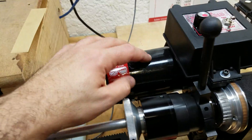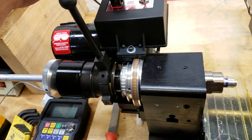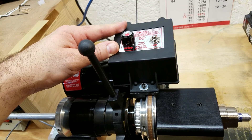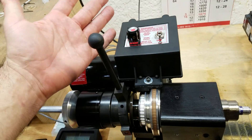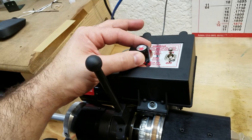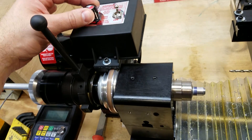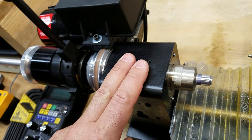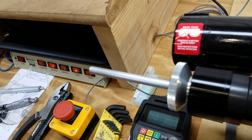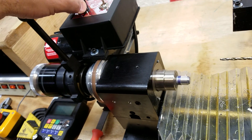What else do we have over here? We have a 90-volt DC motor and a pretty standard motor controller. All this is made in America — I believe this is all domestic stuff. I took this cover apart and looked inside, and this is a motor controller from KB Electronics, so very high quality stuff. Nothing cheap on here. It's well made and very basic: you have off and on, and one knob to adjust the spindle speed. It's very quiet. It's probably going about 1,500 RPM right now, and there's very little, if any, vibration — which is pretty good when you see how far I have that stock sticking out. It's very smooth running and very accurate.